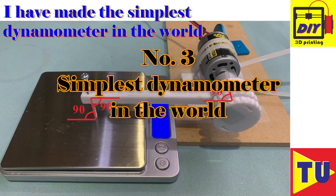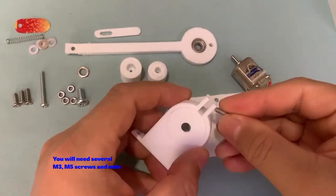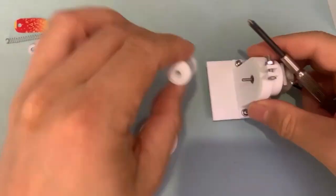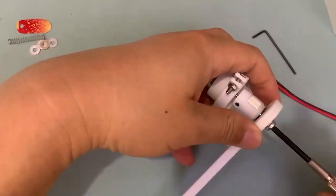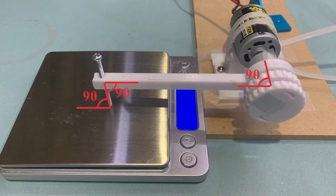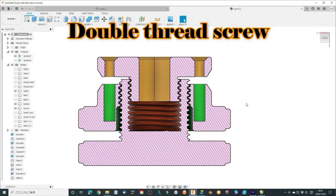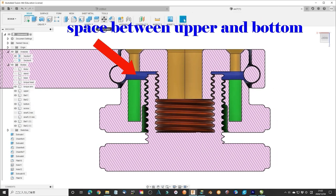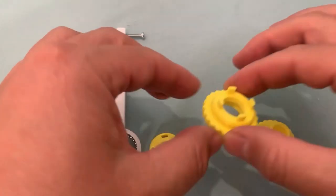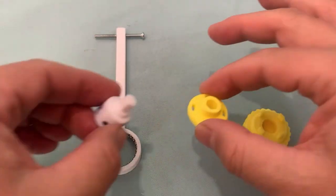Number 3: Simplest dynamometer in the world. First I designed a friction torque meter to study the performance of motors, gearboxes, and other components — it also measures torque and rotational speed (RPM) simultaneously for a motor or rotational engine. After several months of use, I found I could make a better friction source that is easier to use and control. I used a double-thread screw and ball bearing structure to fulfill this goal. The double-thread screw allows very smooth and controlled adjustment of the friction force, and the ball bearing structure keeps the friction force steady and reliable. It is the simplest dynamometer in the world, as far as I know.